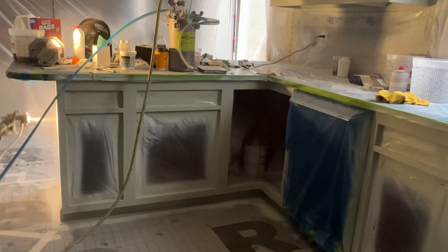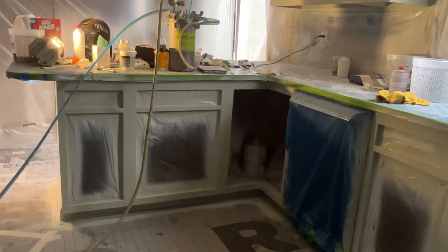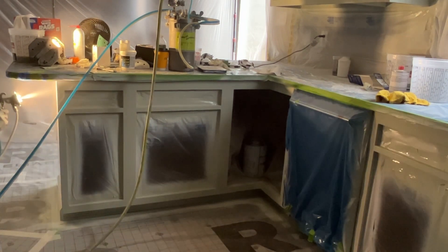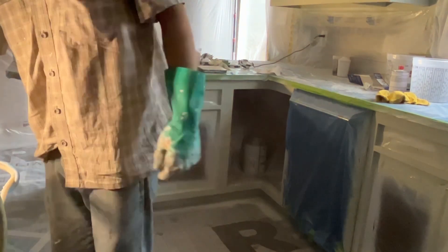A couple of things about pressure pots: if you're spraying cabinets down below like base cabinets, you don't need as much pressure as when you're spraying wall cabinets up high. Whenever you're spraying higher than where your pot is, it's going to take a little more pressure. Another little secret is that pressure pots can slowly lose pressure as you're spraying. So open up your nozzle pretty far, but don't spray with it all the way open immediately because you'll have too much pressure. Start slow — pull your trigger back about halfway and let it slowly start spraying. Then as you need more fluid, you can continue pulling your trigger back. That's what you need to do with a pressure pot because of the nature of it.